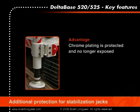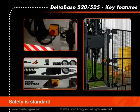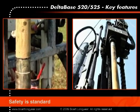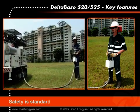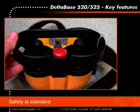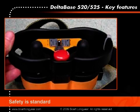A special feature of the DB525 is the use of dual tube stabilization jacks. Standard safety features for this CE compliant drill rig include emergency shutdown buttons and a safety cage with low speed, low torque rotation for safe rod management. A hydraulic remote control allows the operator to remain at a safe distance when maneuvering the rig through adverse terrain or during loading and unloading on a trailer. The optional lightweight radio remote control for driving allows the operator to increase the distance to the drill rig even further.